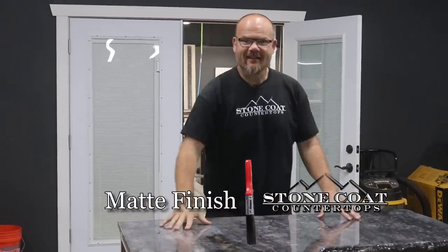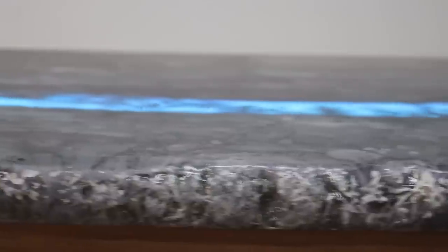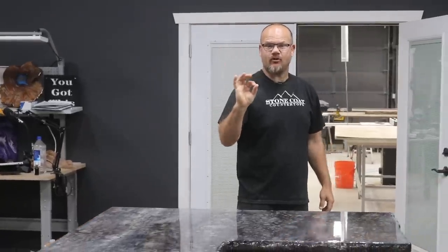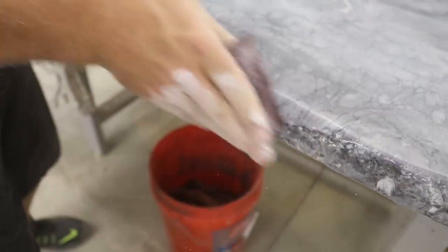What we're going to do is take this piece and give it a matte honed finish. I'm going to do a lower sheen, and also do this rock face edge in a lower sheen — but my sandpaper isn't the right tool for that because it has high and low points. We're going to use steel wool or synthetic steel wool.